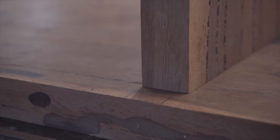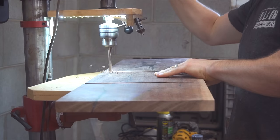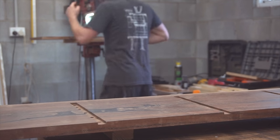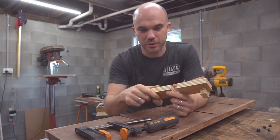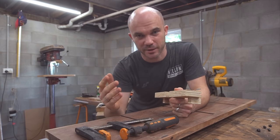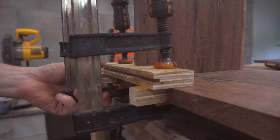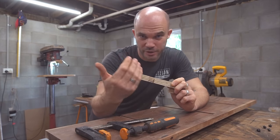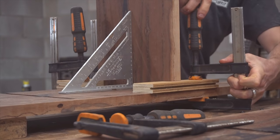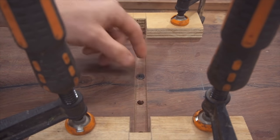There was one side of one shelf done — five more to go. Next I'll get started on the joinery. I'm going to be using dowels; the dados are really there just for alignment when I glue it all together. I'll be using this jig to make sure that I inset the shelves about seven millimeters, which is going to make space for the six millimeter panel at the back. It's a piece of wood with two tabs glued underneath that ensures seven millimeter clearance, and a notch on the other side for the shelf to slide into — allowing me to punch holes for my dowels in exactly the right spot.